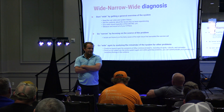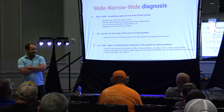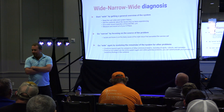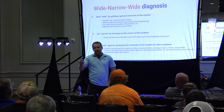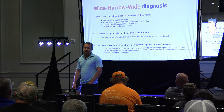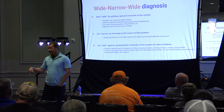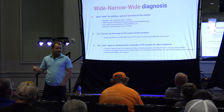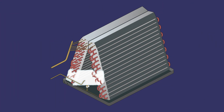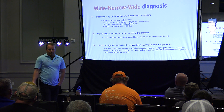He said, 'It just kept going in — the pressures weren't where they were supposed to be.' I said, 'That's not how that works.' Trust me, from now on he uses a scale. If you've looked at the line set length and put more than a couple ounces over the chart and your pressures still aren't where they're supposed to be, go ahead and stop. If you've got way too much charge in a system, there's a very good chance it has a restriction, a metering device issue, or likely an airflow problem — because somebody was putting refrigerant in trying to get suction pressure up. If suction pressure isn't high enough, the evaporator coil freezes up.